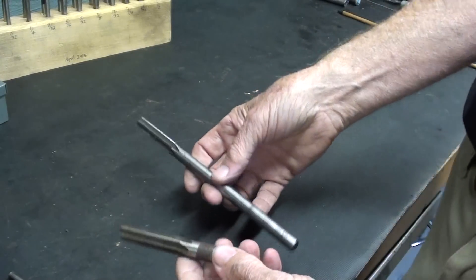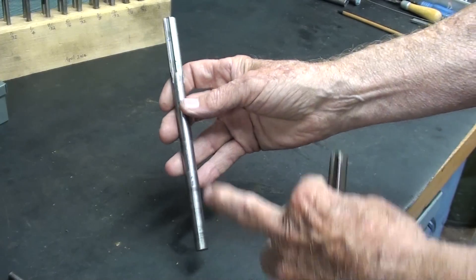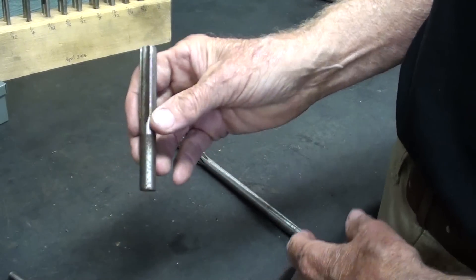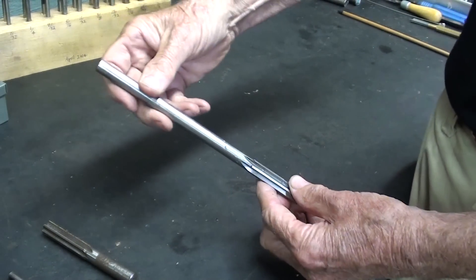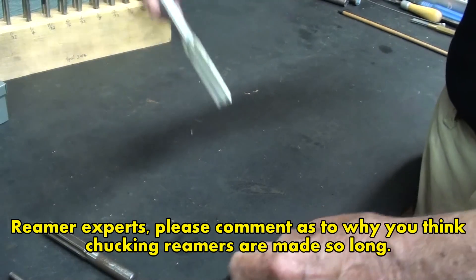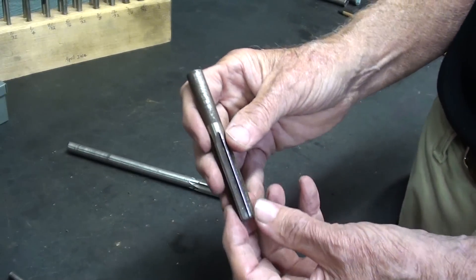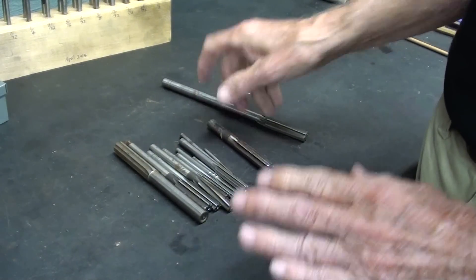About 50 years ago, my brother took a whole bunch of chucking reamers — he hated the length, and there's a reason for that. When you go to set this up in a drill press or a mill, you have to raise and lower the table constantly because these are so blame long. So he cut them all off, and then found out that to some extent that didn't work, because apparently the reason for this really long shank is to allow some flexing in the shank to help the reamer align with the hole. When you cut them off, there's going to be very little if any flexing, and they may ream oversized because in effect you have changed this a little bit to a boring bar. So don't get carried away and ruin all of your reamers and then blame it on me.